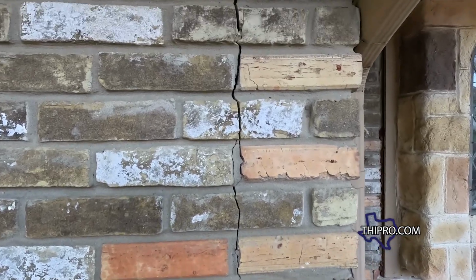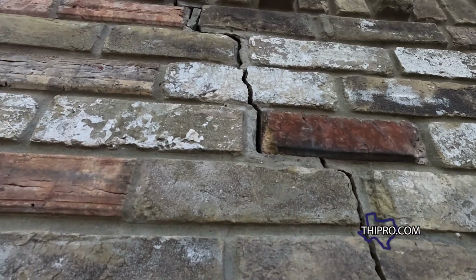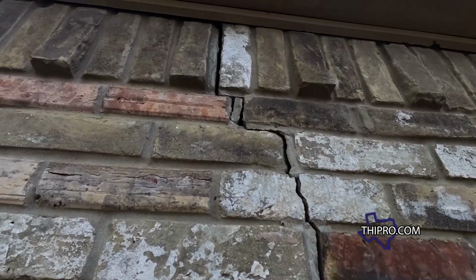This brick is older. We're fortunate that we're able to still find these originals. On the other houses, when the bricks are discontinued, we have a brickyard where we keep discontinued brick, but we also look around and get a really close match. That way the repair doesn't look like it's been patched up. Our goal is to make sure that the bricks match and then the mortar matches. Once you have that accomplished, the repair is going to be seamless.